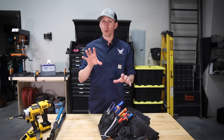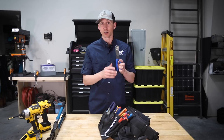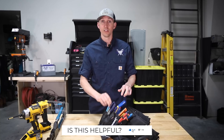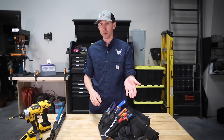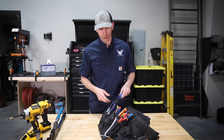Those are all of the wire cutters that I use regularly. Of those three, I would say that the coaxial cutters are the most versatile, followed by the 8-inch diagonal cutters, and lastly the small flush trim cutters. So if you only have room in your tool budget for one of them, the Klein 63-030 one-inch coaxial cutters are the winners in my book.